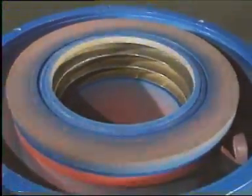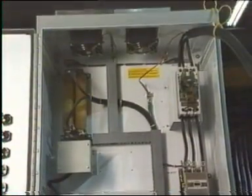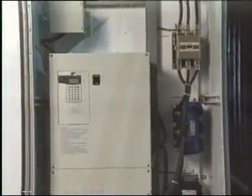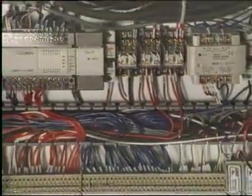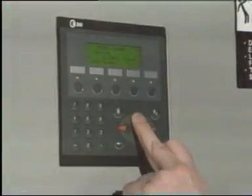Additional features of the SB bowl include elutriated apertures — holes where water is added through to the riffles. The holes are two millimeters in diameter, beveled, and very short in length. This hole design eliminates plugging of the apertures. The machines are fully automated, requiring very little hands-on experience. The auto pack can be linked to a complete SCADA system to control operation from one dedicated control room, with the machine only checked on a shift basis. The low labor requirements make the economics of the unit incredibly attractive.